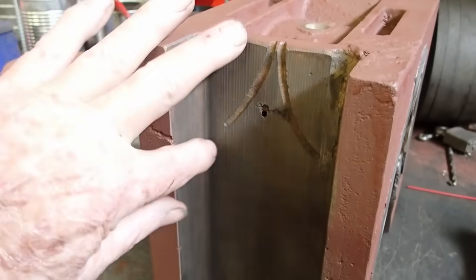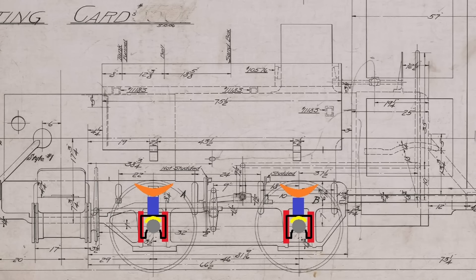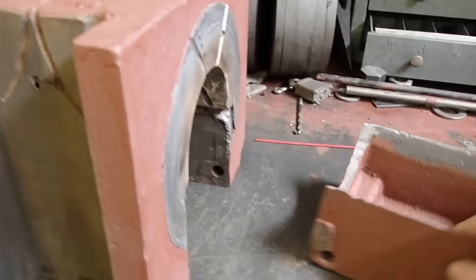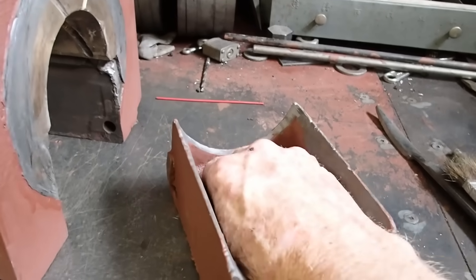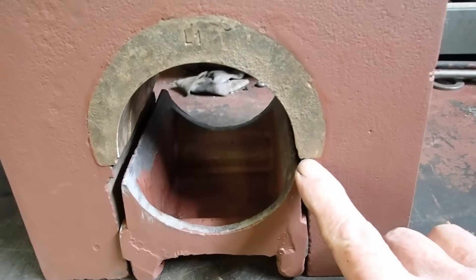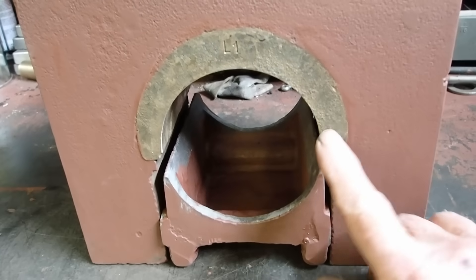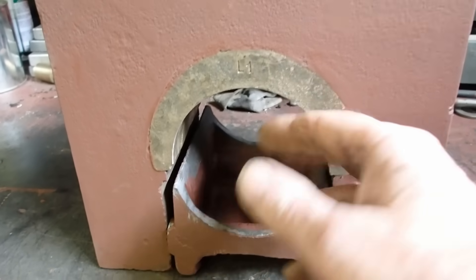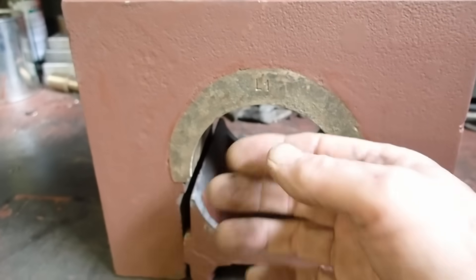Oil is applied and works its way down both ways. There's a spring — it sits up on here and the frame member goes through, which is what the suspension is. Underneath there is a little thing called a cellar. This is filled with cotton waste, wool, or some sort of absorbent material — a pad that fits underneath and is held there. The axle turns in here and rubs on the waste, which picks up the oil from this cellar. The brasses are fitted in here and keyed so they can't move one way.